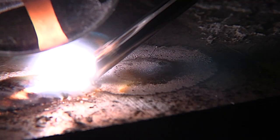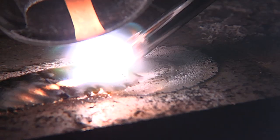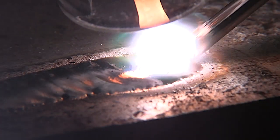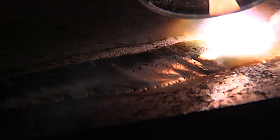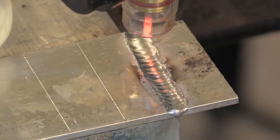Let's just quickly run a bead on that same piece of aluminum. This just squishes all the fun out of TIG welding aluminum. Crud floating around in the puddle, and it's almost a guarantee if we were to grind that off, sand it off, there'd be some porosity in that.